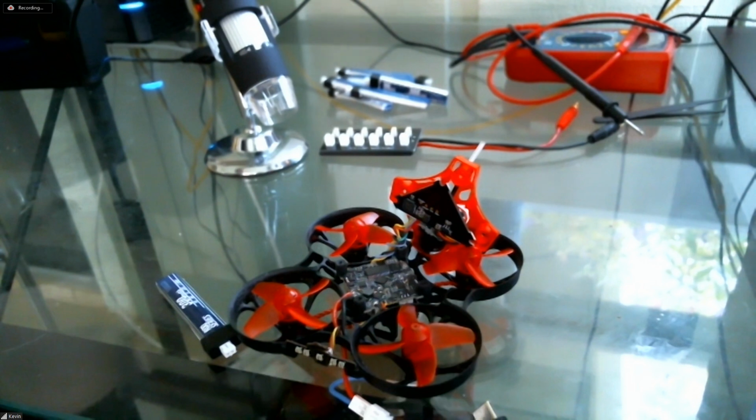This trash can came out of the box and set up on Betaflight fine. And then after getting a test flight in, I would lose RX signal, which I found out could be from D16 mode. Like I said, I'm new, so all of these terms are pretty new to me. So I tried switching that to D8 mode, and no real change.